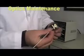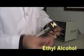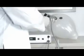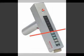Make sure your cooling fan is operating without any obstructions. Smoke and vapor from carbonized debris will eventually occlude your lens. It is essential that you keep this lens clean, otherwise serious damage may occur. This will keep your laser operating at optimal performance. Your temperature gauge will turn black up to the correct number. Do not allow your diode to exceed 160 degrees.